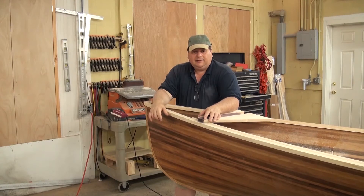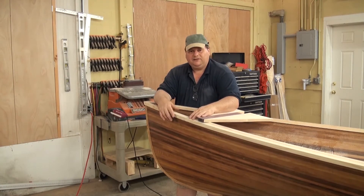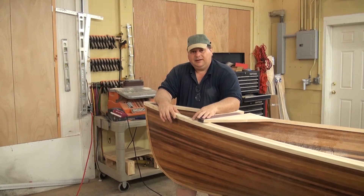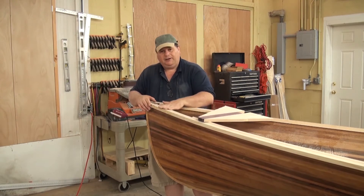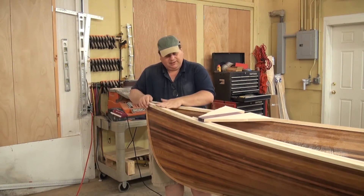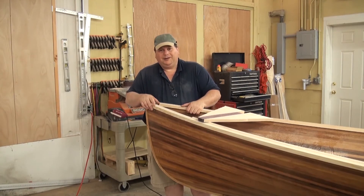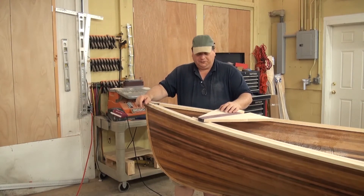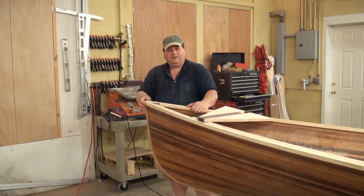You use the tools that you've got and that you can make work. My favorite series of tools: I always start with the chisel because you can take off a lot of wood really quick with that, but you've got to be careful — make sure you have your stop lines there and you're not chipping things out. Then I go to a rasp, because you can control it really well and take wood off over a wide area. Then I come back and finish it up with the belt sander to smooth everything down. It's always worked really well for me. It's not elegant — I don't have old block planes or spoke shaves — but it does the trick, and it's worked for not only me but thousands of our customers. Use the tools you've got and the tools you're comfortable with.